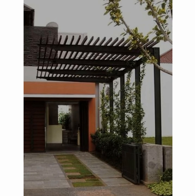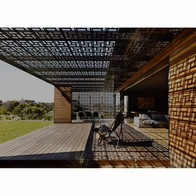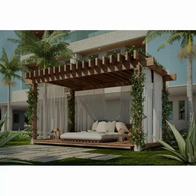it's best to dig to frost depth if greater than 24 in. for your footings to prevent frost heave. Our existing patio was built over a sand and compacted gravel base, so we removed only the stones necessary to dig the 12 in. diameter holes to secure the posts. Build a pergola over an existing patio instead of building a new one saves you time, money, and work. If you'll be adding a patio later, be sure to pour all the footings at the finished patio height. Keep in mind any slope — most patios slope about 1/8 in. per foot to drain.